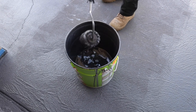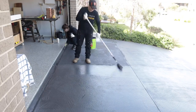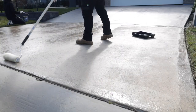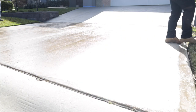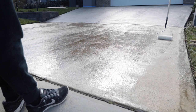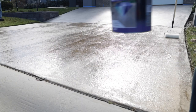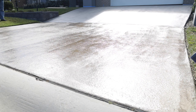On the second coat I made sure to go in the opposite direction to the first coat. Here are some quick facts: the paint dries within an hour depending on temperature. The instructions say not to drive on the driveway for five days, but we left it for seven days just in case. We applied two coats which was enough, but we had enough paint left for a third coat on the main section, so we used it rather than waste it. A driveway should be resealed every couple of years — something I didn't know before. For a couple of hundred dollars and a day's work, we're thinking we'll do it every 12 months to keep it looking fresh. Overall, this is a super easy DIY project that can add value and appeal to any house.